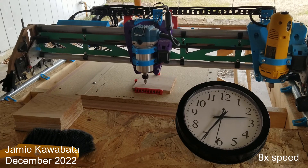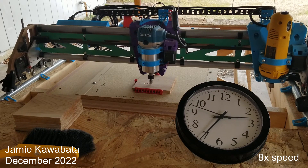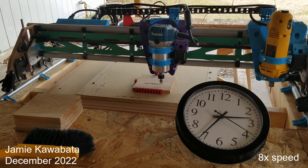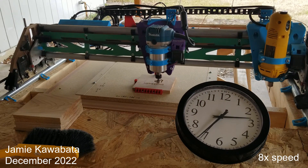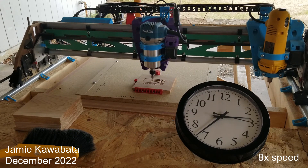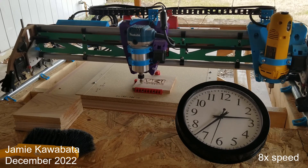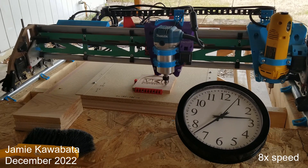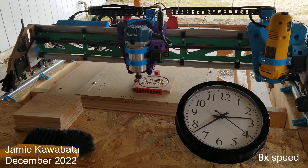This is a lowrider CNC machine where I'm utilizing an existing feature in Marlin to drive dual independent X carriages. Marlin firmware is a piece of software widely used in 3D printers, and it also works well to drive CNC machines. For a very long time, Marlin has had the ability to drive two independent X carriages on a shared gantry. In such a setup, the two carriages move together in the Y and Z axes, but can move independently in X.